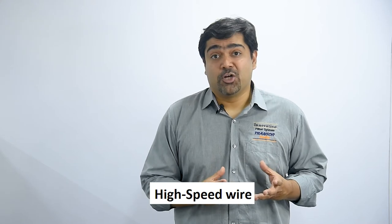You will often hear machinists talk about high speed wires or stratified wires. These are wires with a copper core inside and a zinc outer layer. They provide the electrical conductivity of copper, which means you can cut at twice the speeds. However, they are also twice as expensive compared to other wires, so machinists prefer to use them mainly for rough cuts. Using plain copper wires only is pretty rare.